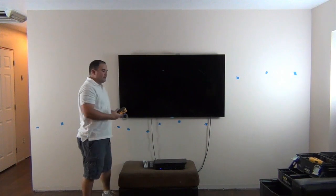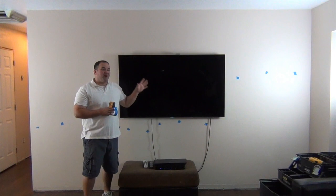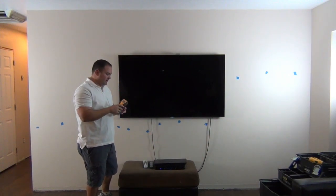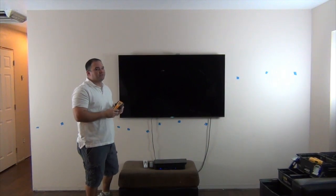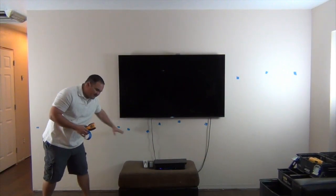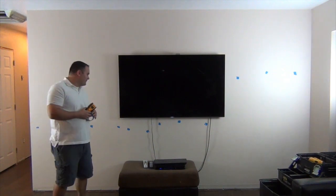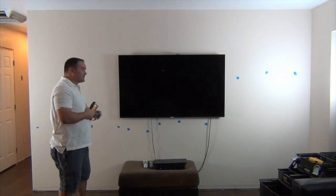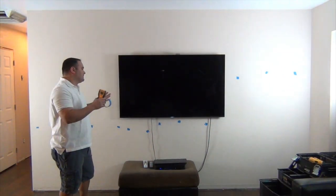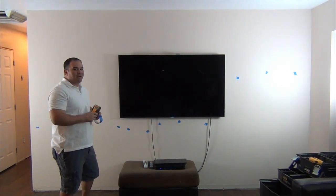There we go — that's a pretty rough idea of where all my studs are on this wall. I'm not 100% positive that I have a stud behind each piece of tape. This is a stud finder — it's a really nice stud finder, but even really nice stud finders will give you false results a lot of the time. I seem to have gotten a lot of studs in one area, so I probably have to go back and figure out what's going on there. But for the most part this is a good start. From here we'll take some calculations, figure out where all my stuff is going to go, mock it all up, and get right back to you.